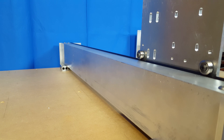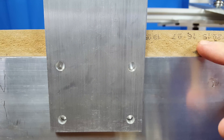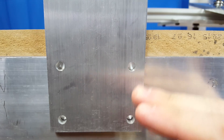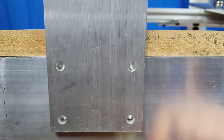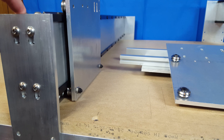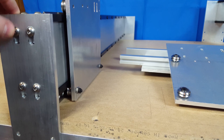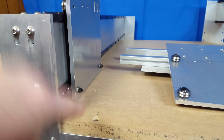As I talked about in a previous video, we've got a couple bolt holes on this Y-axis motor mount plate that need to be milled out a little bit to accommodate the fact that the holes that were drilled and tapped at the end of the X-axis rail can actually fit in there properly. Also, as you can see right here, I didn't calculate enough spacing for the MDF, and we need a little bit more so this plate can actually move up more. So we're going to have to mill this out so that these holes here move down slightly farther, giving us a little bit more play in the plate. The reason for this is primarily because we're already at the height of our extension right here, and we've barely got any clearance on the plate.